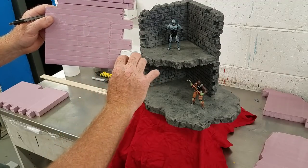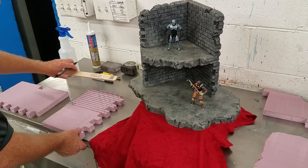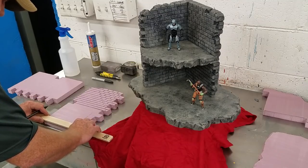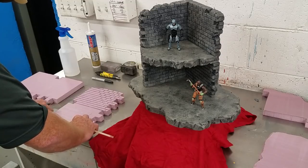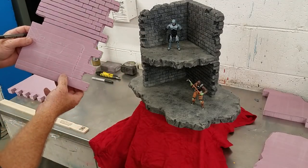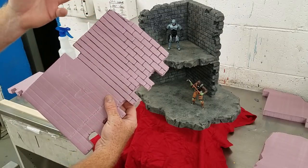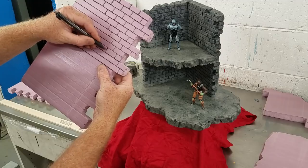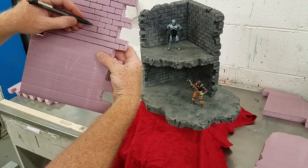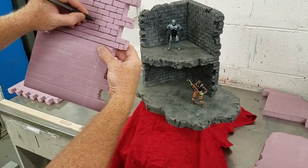The tongue and groove goes about an inch up all the way. What I do is score with this stir stick right here — you can use a ruler, whatever you can find around the house. I basically just turn it at about a 45-degree angle and press it in so it gives me a nice indention. I do that all the way up. I've already started on this — I just use a regular ballpoint pen to lay everything out. I'll do it lightly at first so I know exactly where I want the grout joints, and once I'm certain that's where I want it, I'll go ahead and press in a little deeper.